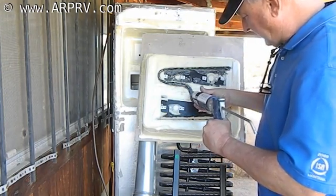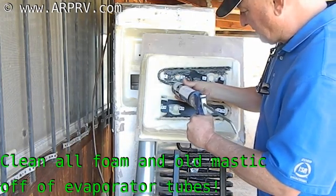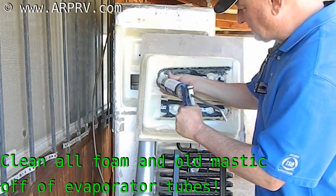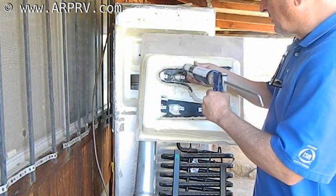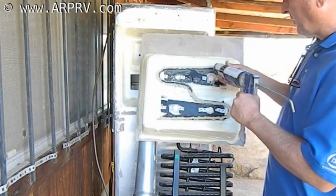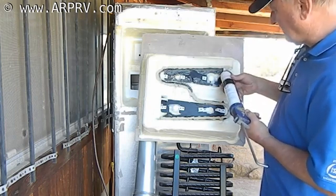I'm going to get down in here between these tubes — you can see how I dug out down there. I'm going to do my first pass because this tube's thick enough that it's going to need two passes done. This is why I dug all the foam and all the old thermal mastic out — I want a really good seal here.